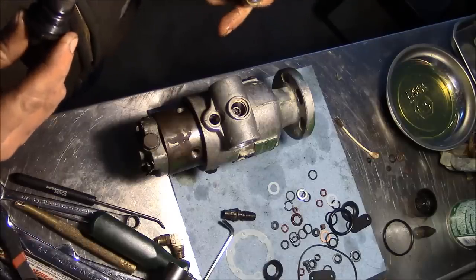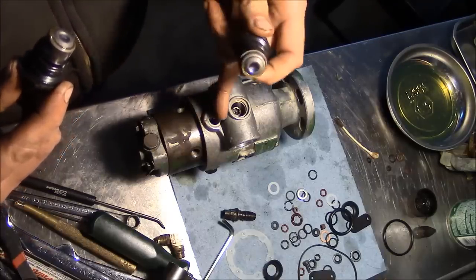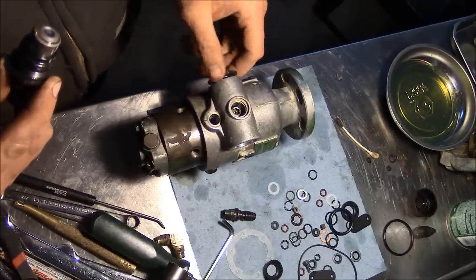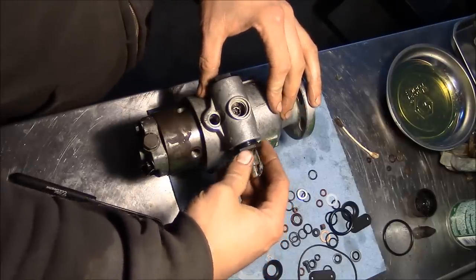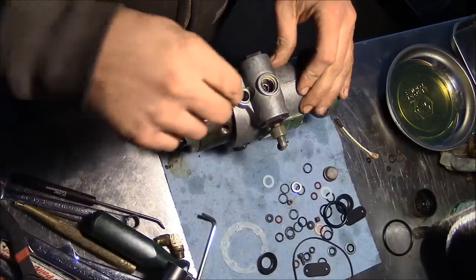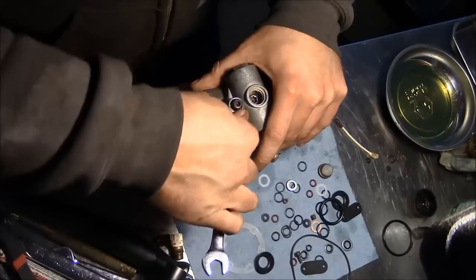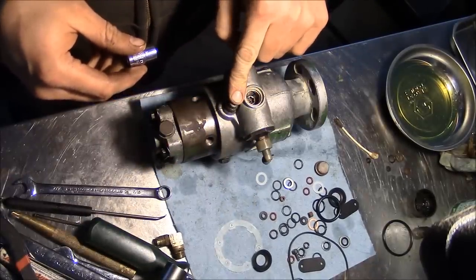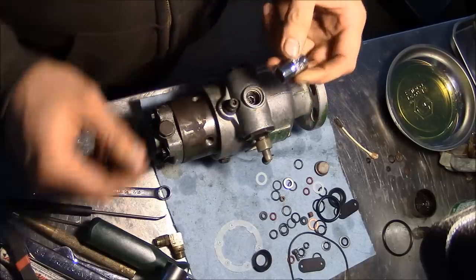So the piston goes in from the side that has the drilled passage. It runs basically out towards this hole where there's a check valve. And it's also going to be marked with a single C. And then the spring obviously comes in from the opposite side. Okay, now we can install this little head locating bolt, they call it. Okay, then they want you to torque that to 300 inch-pounds. And you'll need a 7/16 12-point socket to do that.